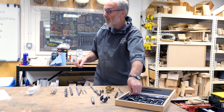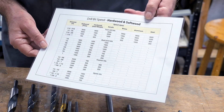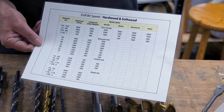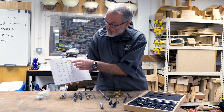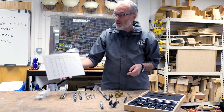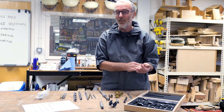There's a wide variety of different types of drill bits, and we've also produced a little chart which you can download under any of our hobby or trade drills. You can laminate it and stick it on the wall next to your pillar drill — it gives you a handy quick reference covering diameters, different drill bit types including twist drill, brad point, Forstner, and spade bits, plus a selection of materials: hardwood, softwoods, acrylic, brass, aluminium, and steels. It gives you a quick at-a-glance guide to what drill bit speed you should be using for various materials.